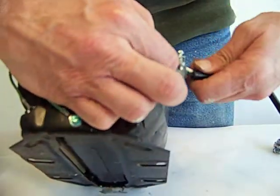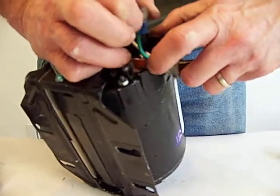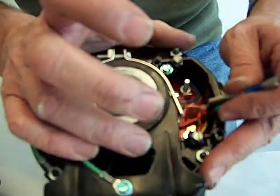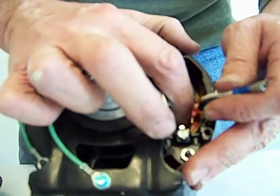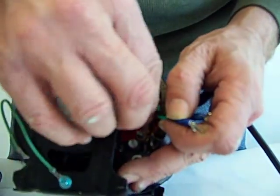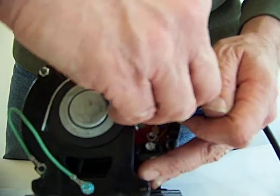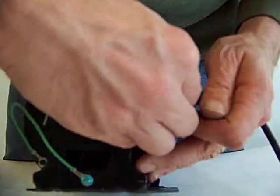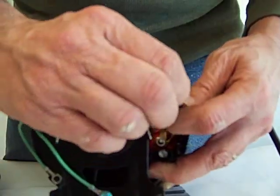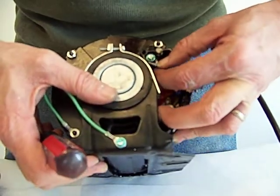Okay, that came through quick. This is a 110/240-volt motor. We have line one and line two — that's basically all we're concerned with. The white wire is going to the line two connection. The black wire is going to the line one connection. And the green wire, which is your ground, goes right underneath the green screw.